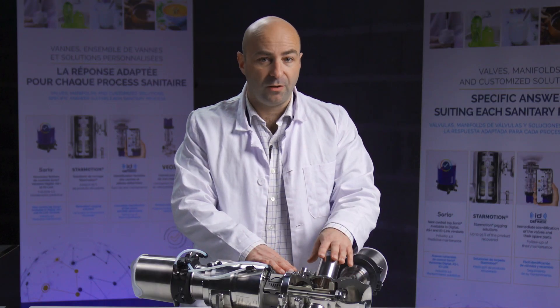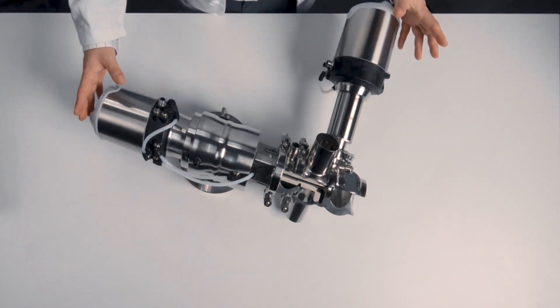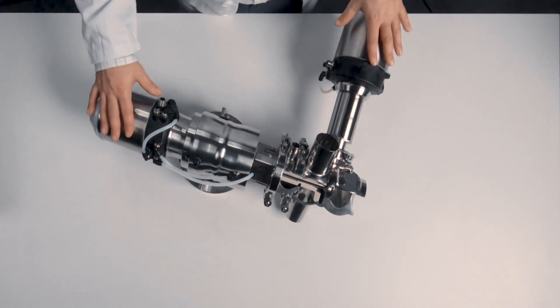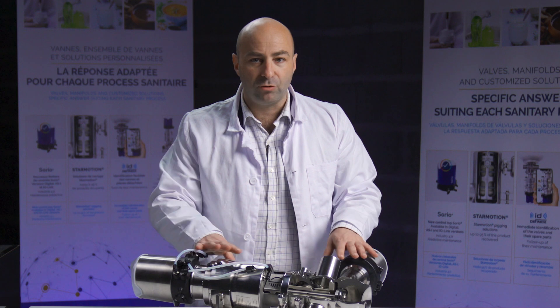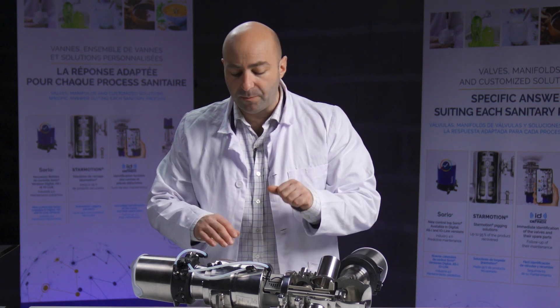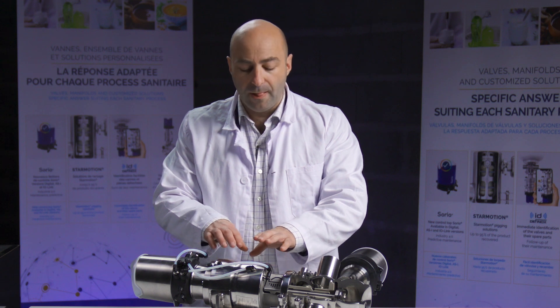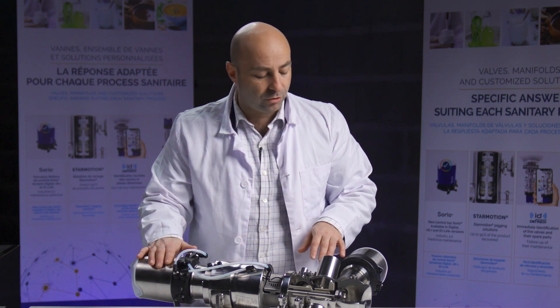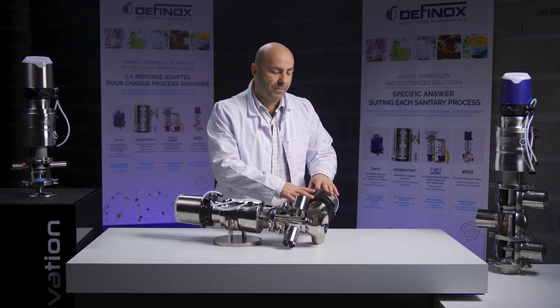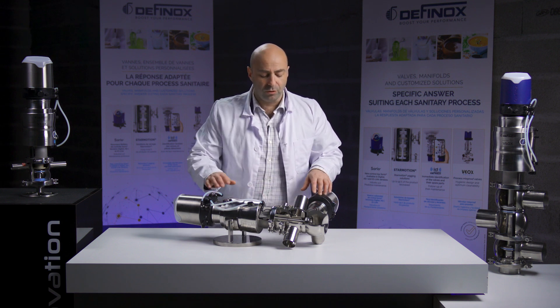What is interesting in this valve is the general layout. It uses only two actuators to drive the whole process: one dedicated for the main plugs, enabling upper and lower lift with one control top here, and a side valve dedicated to leakage and drain of the steam with its own control top.